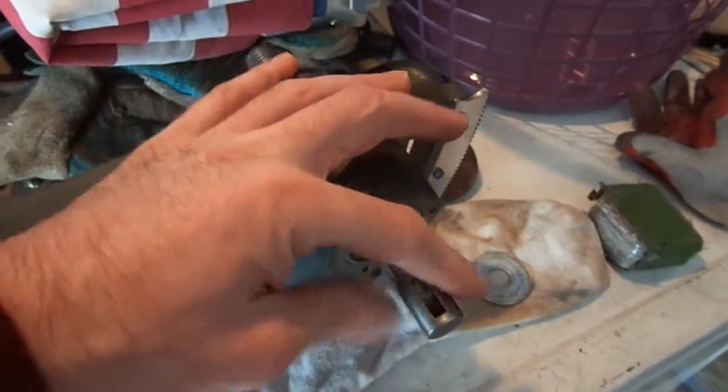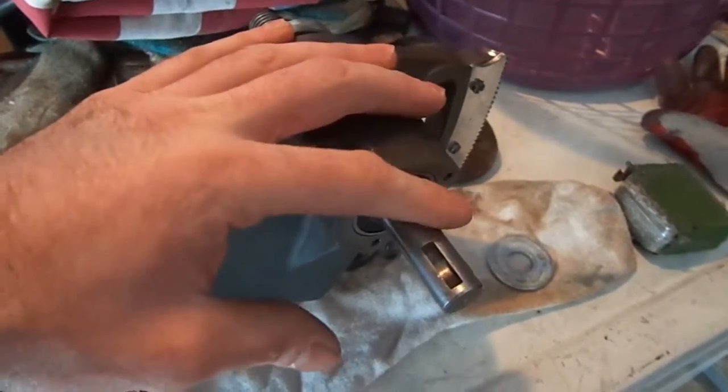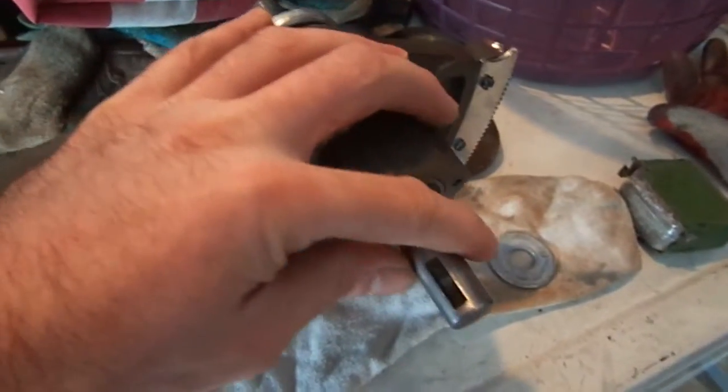Make sure you oil the shaft too. Just a little light oiling before you slide the bearings on. Put it in the freezer overnight. Make sure it's nice and cold, and get those bearings on as fast as you can. Believe me, it makes all the difference.